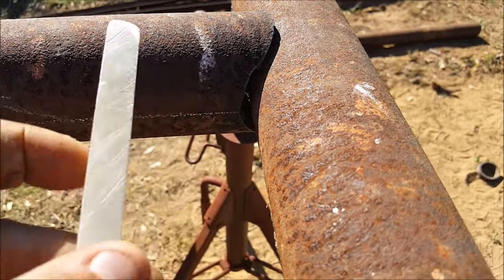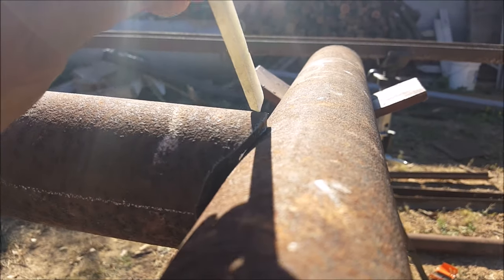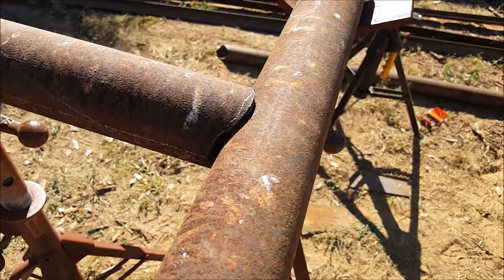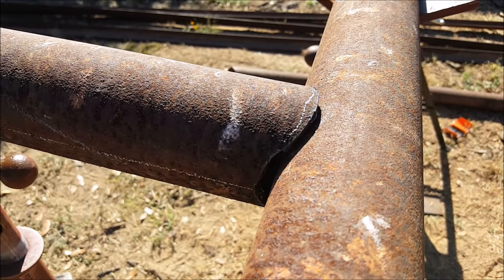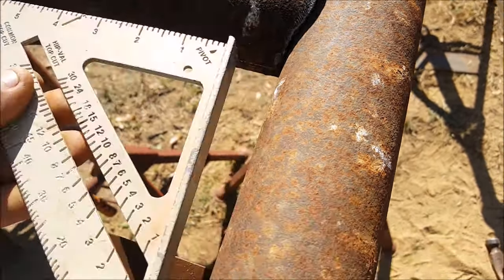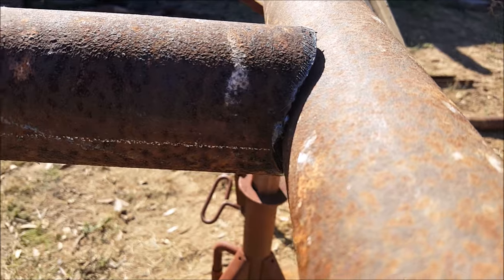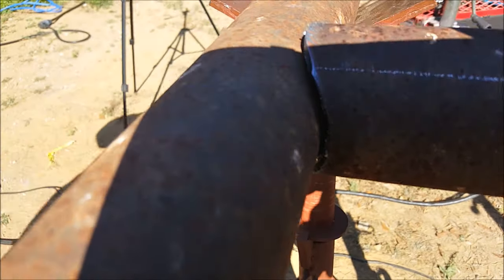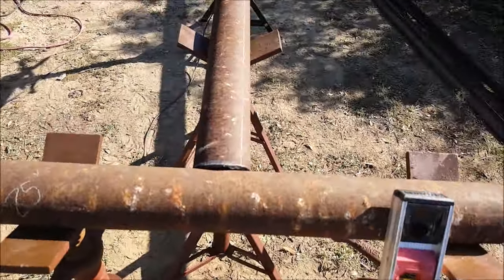I got about a quarter inch gap on this side, and what I have to do is bevel the inside part down a little bit, or notch it out, and it should bring things closer and make them a lot stronger and easier to weld. I was able to bring things closer — I knocked out the top and bottom parts and the gap is minimal on both edges, maybe about an eighth of an inch, which will fill up nicely with a 6011 on an AC welder.